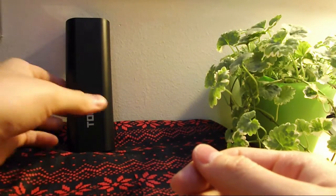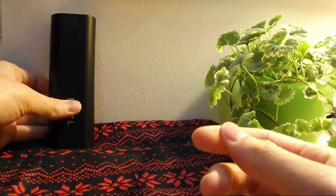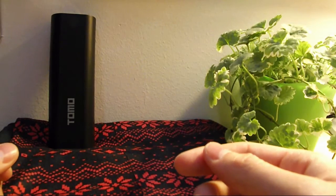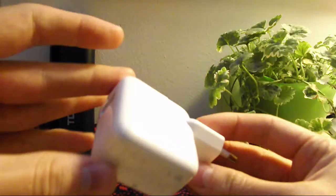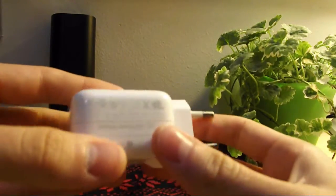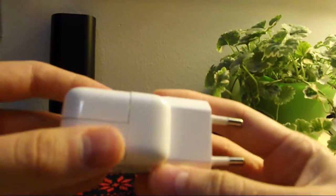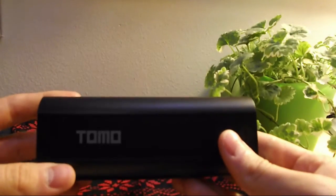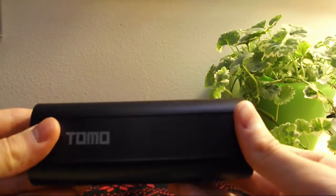And the beauty of these little products is basically you don't have to rely on those cheap AC to DC converters, which have probably very unstable current delivery or unstable voltage delivery, because you could just use your own USB charger. You can use something like a 2 amp Apple charger, which is actually quite well built considering Apple usually tends to skimp on power circuitry on their MacBooks and so on and so forth. So this is a good charger, and you can pair it with pretty much any USB output port. You could even put it on a PC output port for very incredibly stable voltages.